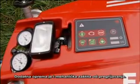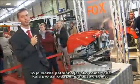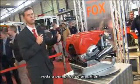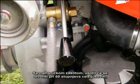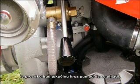Another optional extra is a mechanical overheating protection. This may be needed because if no water were delivered for a long period, the water in the pump would overheat. With the overheating protection, a thermostatic valve opens at 60 degrees centigrade. The pump is flushed once and is then refilled with fresh water and cools down.